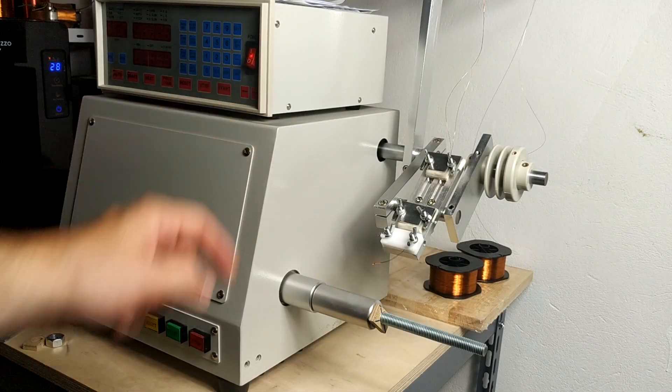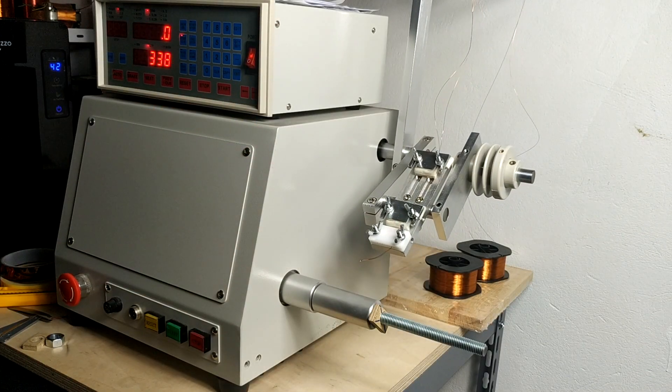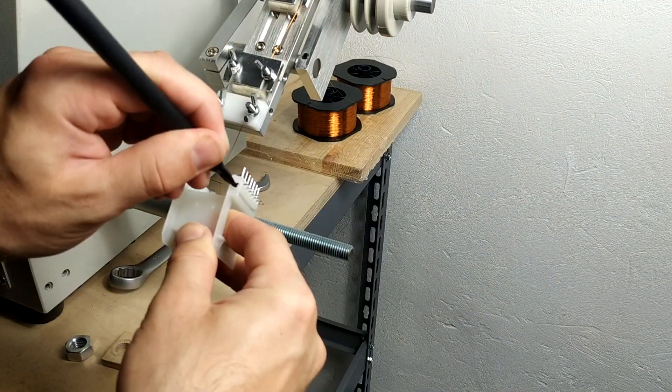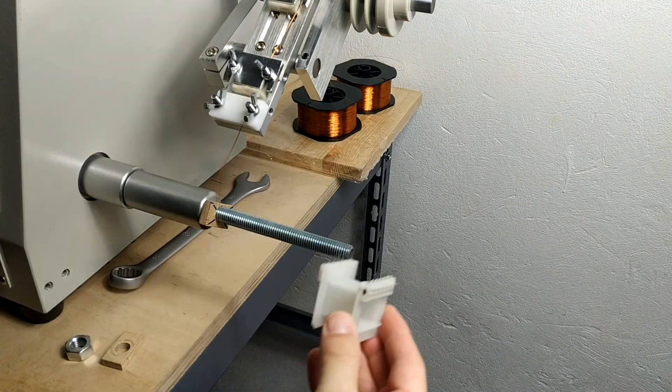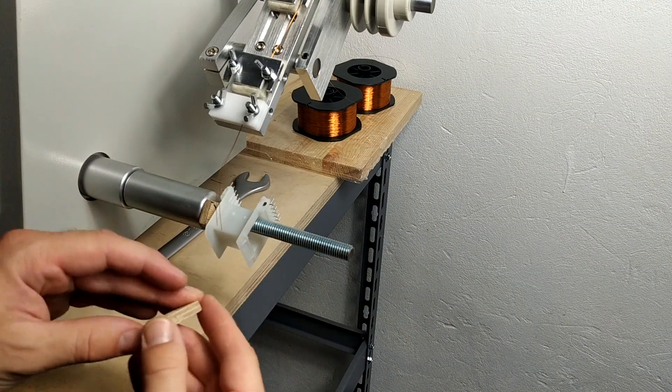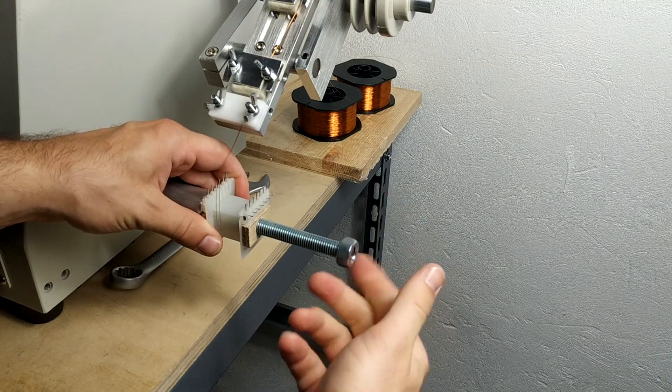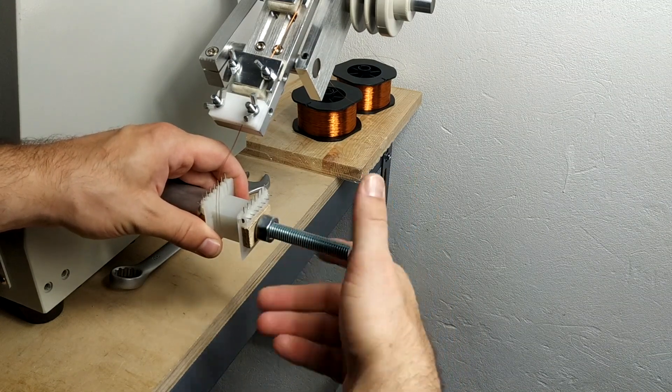Primary and secondary are in a 1-to-1 ratio. There's also a tertiary winding violet-gray which is also in a 1-to-1 ratio to the previous windings. It is wound as a simple thinner gauge winding and used for feedback. And finally there's another feedback winding which is in a 1-to-10 ratio to the rest of the windings.